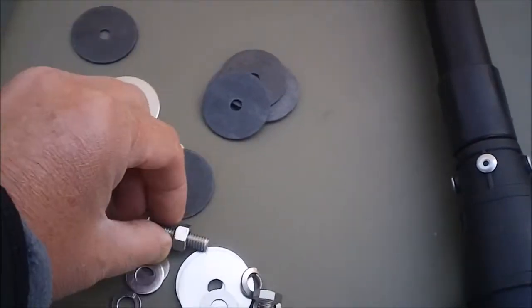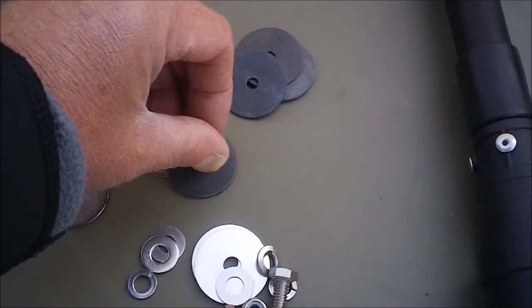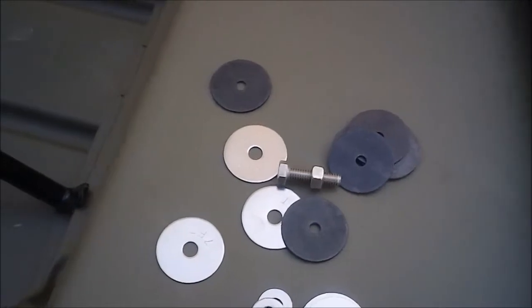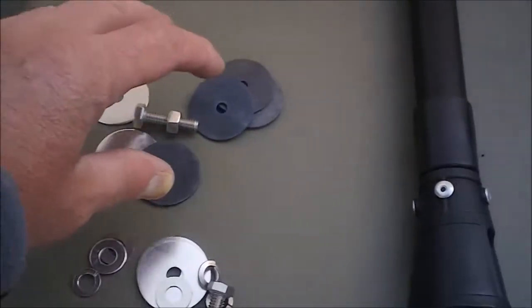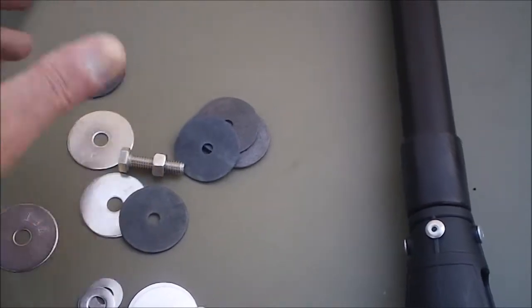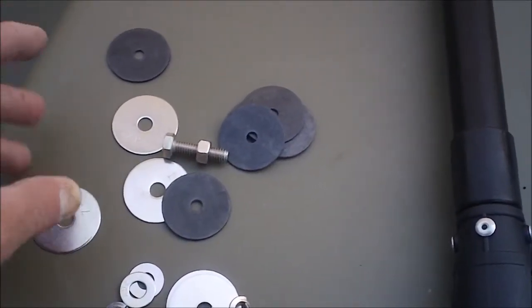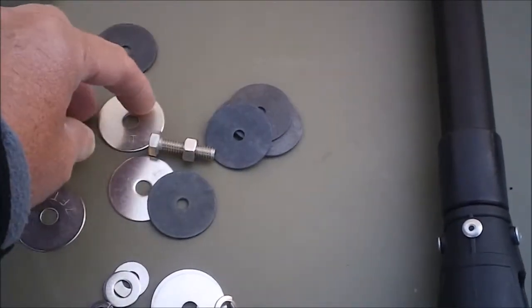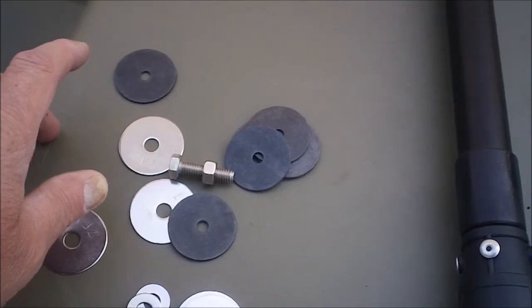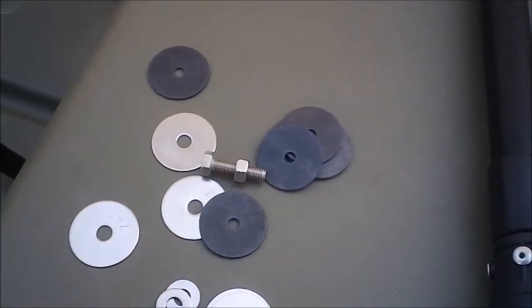They're a little bit smaller than the nuts so that they'll have to displace them a little bit, so hopefully that prevents leaking. This boat is currently bone dry and I wanna keep it that way. I will probably end up putting a little bit of silicone on this too. I know 5200 is an option, I just don't have any on me, and I'm pretty sure that with all of these washers and rubber here that regular silicone will work fine. If it doesn't work fine, I will then get 5200 on that. So I'm gonna do that now.